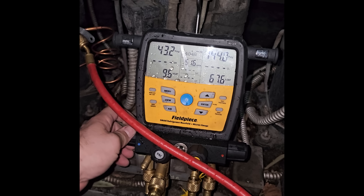Now we're doing a lot of other repairs that I'm not filming. I've got guys fixing leaks on the walk-in freezer. We went ahead and did an emergency replacement of the dual pressure control on this guy right here because it was not shutting the compressor off. When I got here this morning, it was negative 16 vacuum and not running — the time clock had failed, it was stuck in defrost. We actually need to change the liquid line receiver and possibly change some expansion valves downstairs — that's a problem for another day. We got it going, changed the pressure control, charge is fine for now.